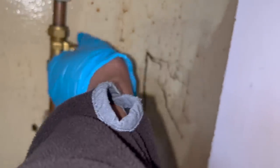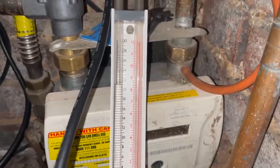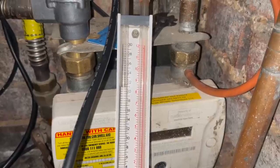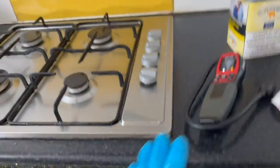What I need to do is isolate this isolation valve here, and then I can go back to the gas meter and do a tightness test again. With both appliances isolated, there's zero drop, which is absolutely amazing because doing a gas run is just a headache sometimes - you've got to move things, lift carpet, lift floorboards. So I'm glad I don't have to do that. I un-isolated the boiler, tested it again, there was no drop, which means it's definitely going to be on the hob.